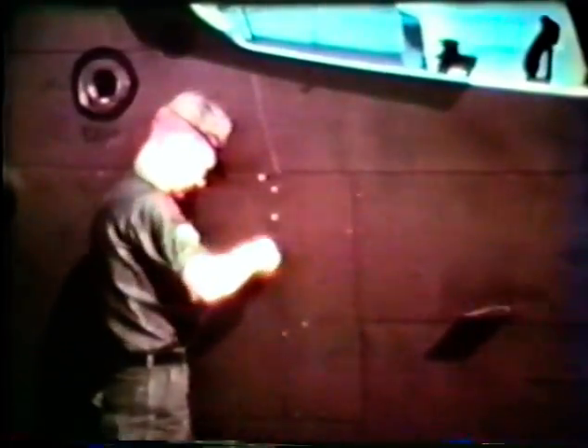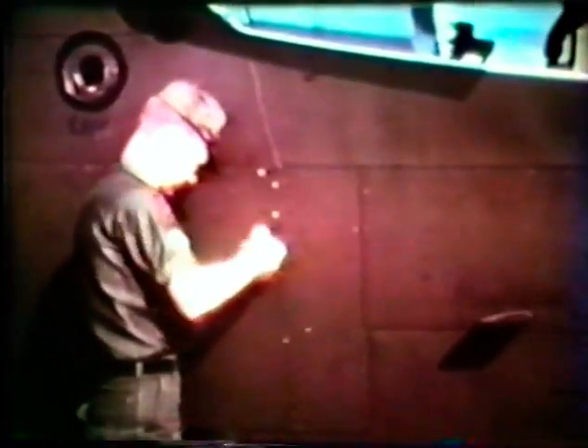It may help you to understand why you have to remove 40 screws sometimes when you know that the panel could be held on with six. Although the panel could be secured with so few, the aerodynamic flight loads couldn't be carried without using all 40. You will also notice the screws themselves — flush Phillips head screws — used because of the aerodynamic integrity of the AH-1G. They require a Phillips head screwdriver in most cases. The Army knows there will be a lot of these to remove and replace, so additional screwdrivers of the right size and type have been added to your tools for this ship.